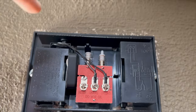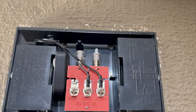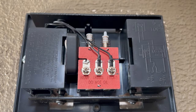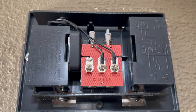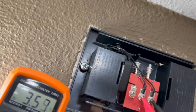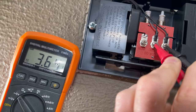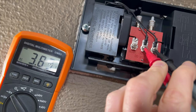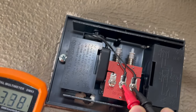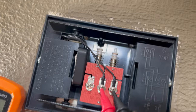That's because this spring-loaded doorbell chime striker, that you see here in the background, is constantly moving up and down a little bit. It's oscillating because these leads are still getting a constant voltage supply, which started happening once I added the G4 Doorbell Pro. It looks like the G4 Doorbell Pro Relay — this little black box here — doesn't appear to be cutting off the low voltage still being sent to the doorbell. We're still getting about three and a half volts constantly being sent to the doorbell chime, causing it to oscillate or vibrate and create that annoying humming.